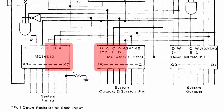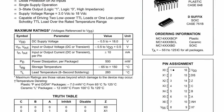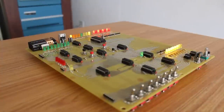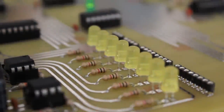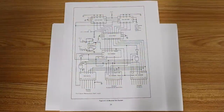And then on the far left, we have system inputs. This is not a register. It is just reading some external input coming into it. So it's just an addressable selection thing, I guess. Now it's important to note that 1 of the bits is actually RR. So we only have 7 external inputs coming in. But we don't need to build any memory into this. So this is read only. And so this is an incredibly simple system, and we've actually built up exactly this on a single PCB. I'll put a link in the description below to that video. It was a really cool video and a really cool system. So this is what I want to build for the UE1 vacuum tube computer.